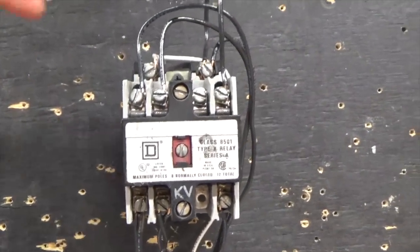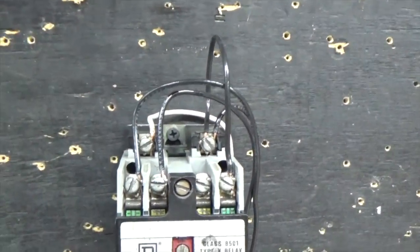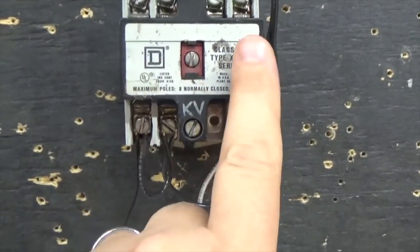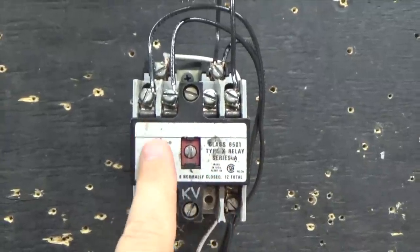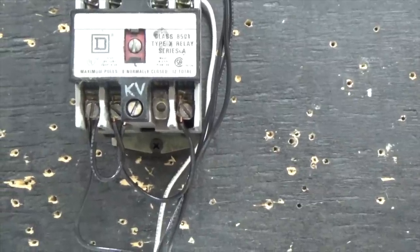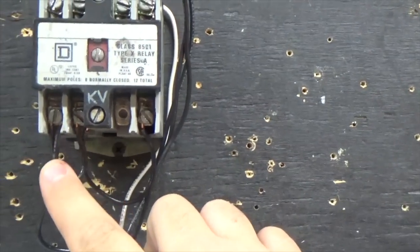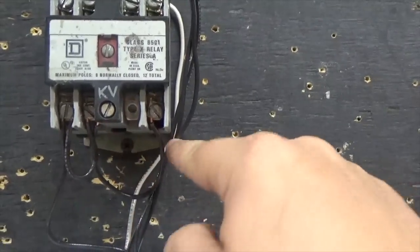Okay. So you can see back here, we've got our coil and we've got our wire coming off of our green button. Our contacts here are set up. On this side here, what I did is I did my lights, and over here I did my hold. This terminal I did not use, so I used this switch, and this switch on the end. What you have to remember is, unlike an 8-pin or an 11-pin relay, the power doesn't get transferred unless you put power on them. So this is one single pole switch, this is another single pole switch. So you can see down here where I had to put the power coming up from my terminal strip to my jumper, and then from the jumper I went over to my hold.